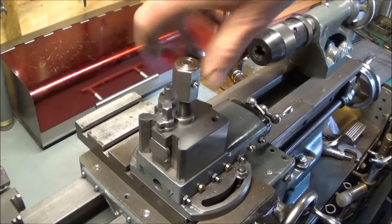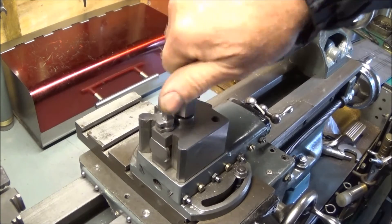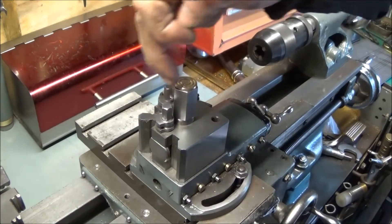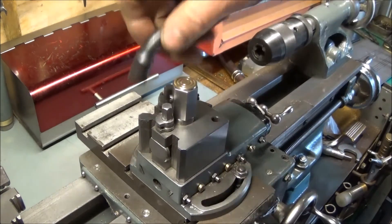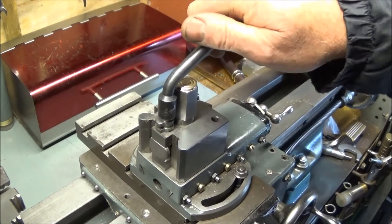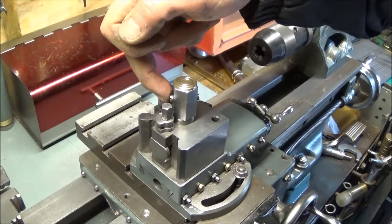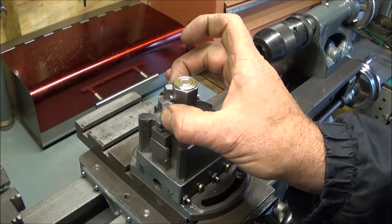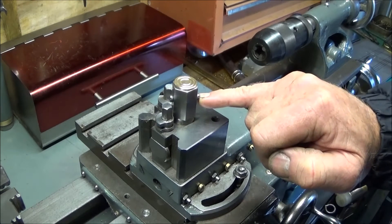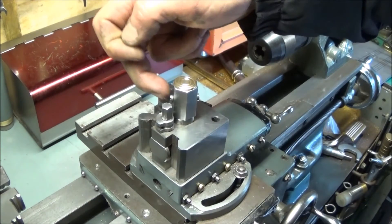When you're making this nut, all you really have to watch out for is that you have enough clearance between the top of the nut and the handle of the socket wrench that goes on the tool holder bolts, and that the screw is either in between the tool post locking bolts or at the back, so that this diameter here will not clash with the screw.